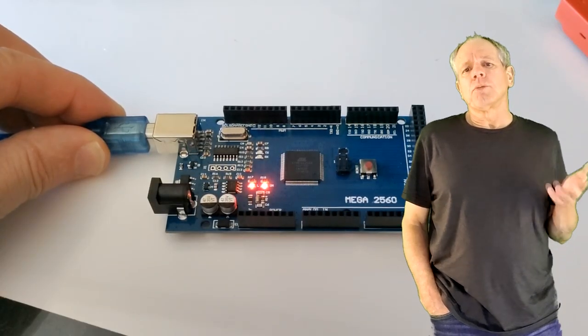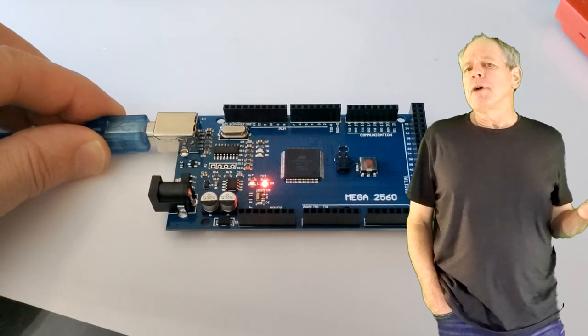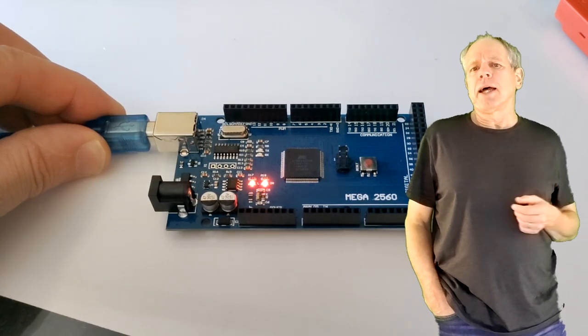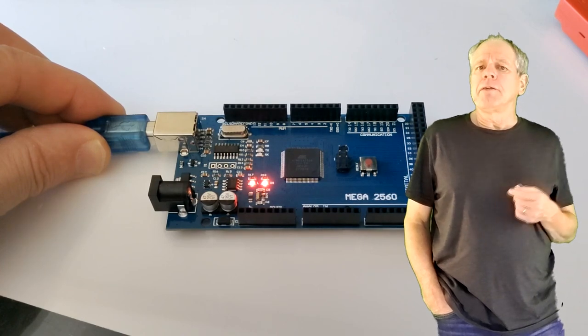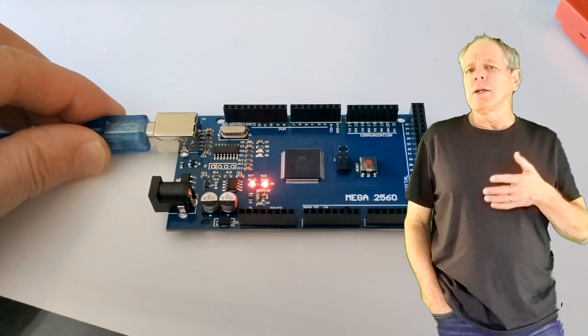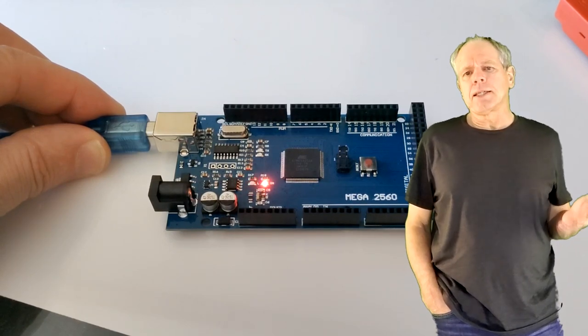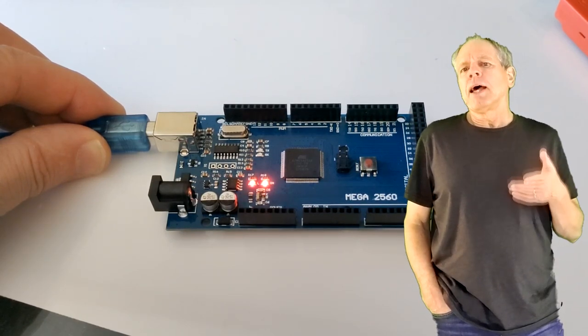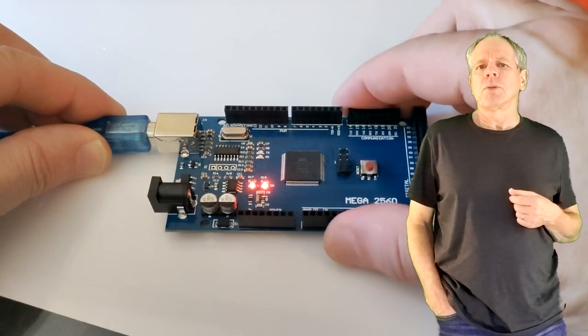The second thing to observe is the onboard LEDs on the Arduino. If everything is okay, the power LED will be on permanently and a second LED will be blinking with a clock rate of about 500 milliseconds. This indicates that the Arduino gets the power and that it runs the blink sketch, which is preloaded on most commercial boards.